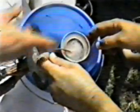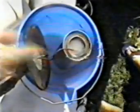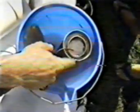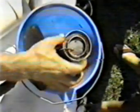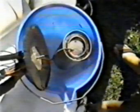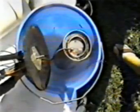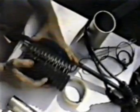With one neutral plate, it uses a bit less than half the amperage compared to negative centre and positive outside. When you put one neutral plate in, not touching anything, your current use is about half. If you put another plate in, two plates, it goes down half of that again and produces twice the gas.